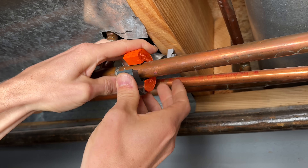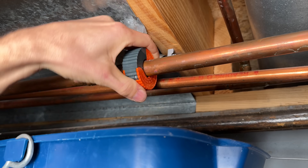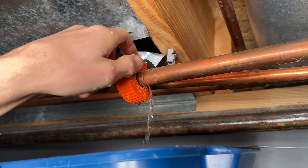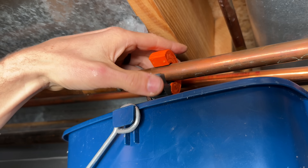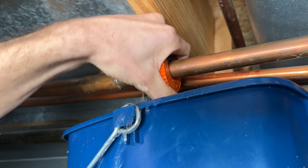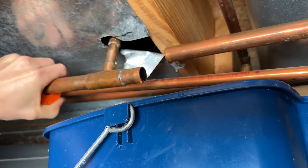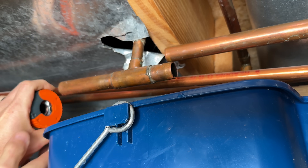This is my go-to for cutting copper pipes — it's the auto-cut tool. It's nice in tight spaces because a normal pipe cutter can't get the rotation when it starts hitting other lines like the half-inch copper right behind it. This one's pretty compact. Don't forget you need your bucket ready to go when you open that up — let it drain out. We'll make our second cut removing that section with the two different failure points in it, let it drain down, and then move on to that final cut.